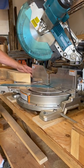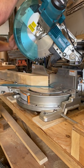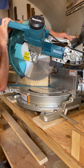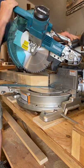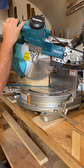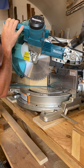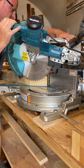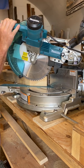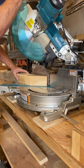I'm going to turn my saw to the side so it's a bit easier. I'll set the board on here, then bring my saw blade down — it was almost set just right. I'm going to set it so that at the very bottom of the stroke it just takes out that line, maybe up a tiny bit. So now every time I come down and cut across it's going to be at the right height.